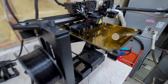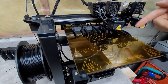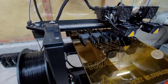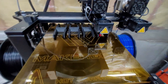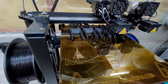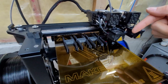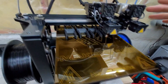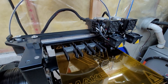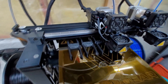As far as printer setup goes, when I first got this thing set up the printer came with a license to the slicer software Simplify 3D, which has been a great software package. But it's by a third party so it's not MakerGear-specific — you have to load a few different profiles to tell it you have a MakerGear system. The first time I didn't go through all the steps, so it knew the size of my build plate but had trouble with the two different heads, and my right head crashed into the left one during my first print.